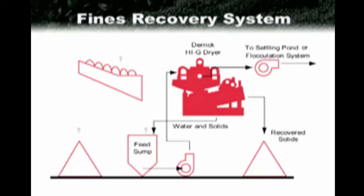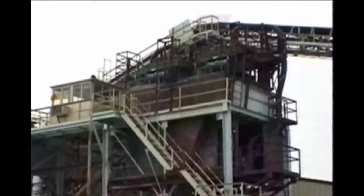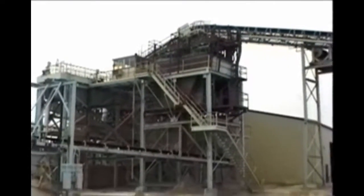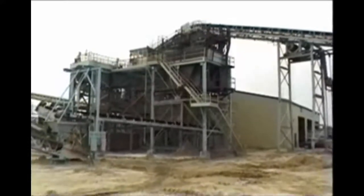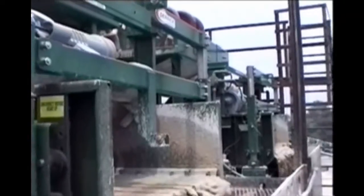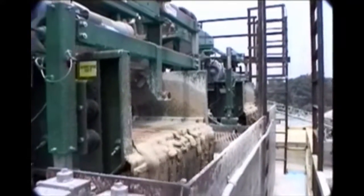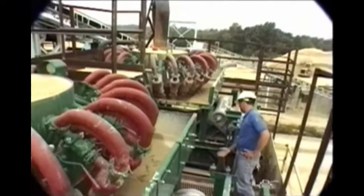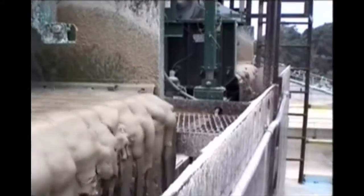No operators are required to monitor the system. This dual machine installation in Brandywine, Maryland consists of two screening units, each being fed by its own 20-way hydrocyclone cluster. In peak load conditions, each machine may discharge as much as 25 dry tons per hour. Operators on site simply start the equipment in the morning, check for plugged hydrocyclone apexes, and walk away from the equipment for the rest of the day. The recovered material is simply blended into a masonry sand and sold at typical sand prices.